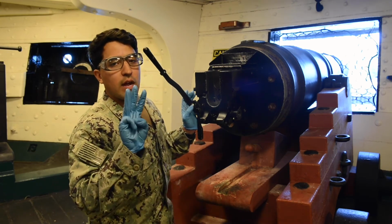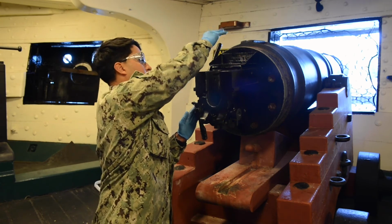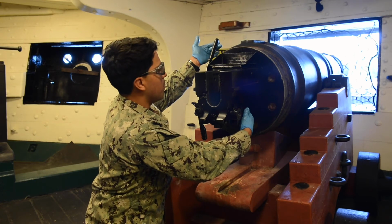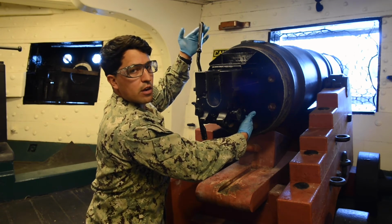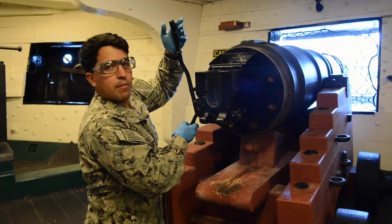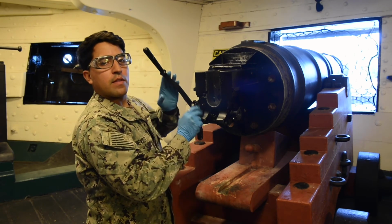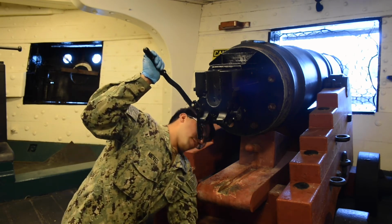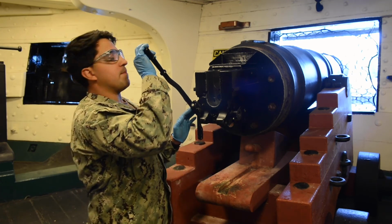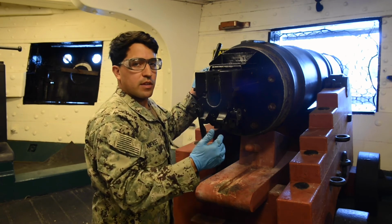You do this a total of 3 times. Push forward, ensure it's clear, pull back on the charging handle, pull back on the extractor lever, ensure it stops, pull back on your safety, lever stop, pull down towards you. That's 2. Check to see if the firing pin is protruding, still is. One more time, because that's what the MRC says to do.